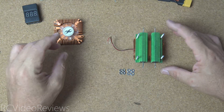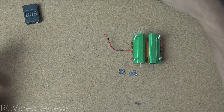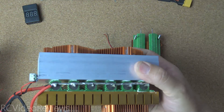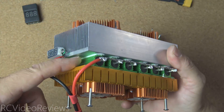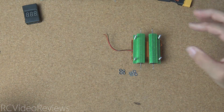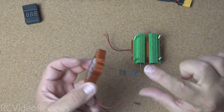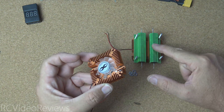We'll drop the second resistor on. Now it's not a bad idea to use thermal paste here to help with heat transfer. When I built the Admiral, I did use thermal epoxy — you can see the white beads between the heat sink and the resistor. I don't think it's strictly necessary in this case, as long as you make good mechanical contact between the heat sink and the resistor's heat sink.